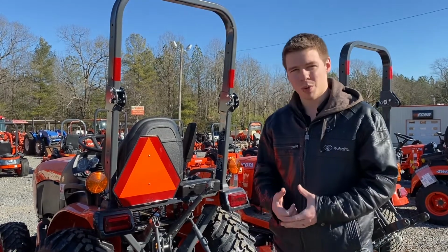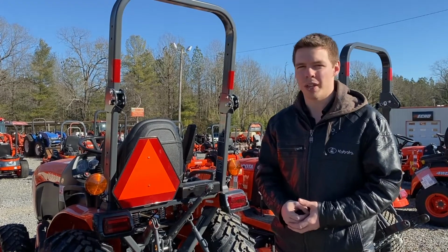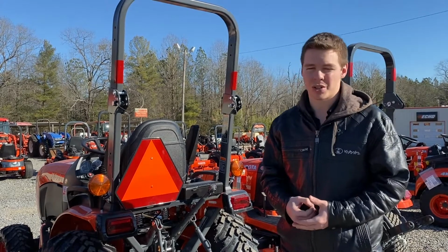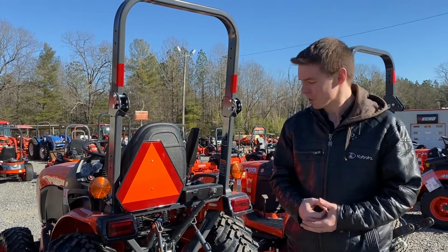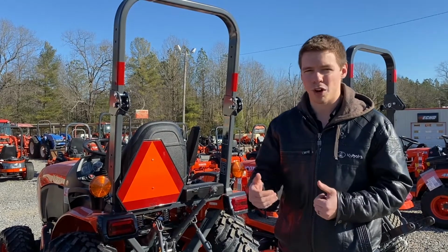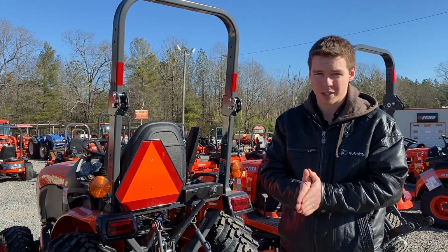So a very good in-between tire, usually a little bit pricier than your agricultural tire or industrial tire, but not that much more, especially when these tires are gonna last you 20 or 30 years usually. So this has been very popular, the R14. You can think of it as a cross between the R1 and the R4. They put the 1 and 4 together, R14.